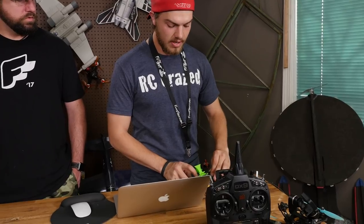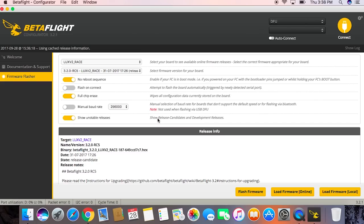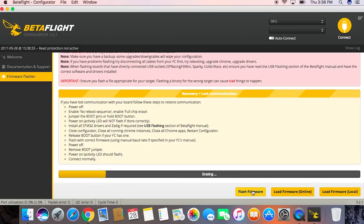In this case we have an easy button, so we'll press it while plugging in the USB simultaneously. That gets us into DFU mode, which we can see in the top corner. Then we'll flash our firmware — it's erasing previous data and will then flash and verify. One tip: I tend to leave it plugged into the flight controller, hold the button, and then plug it into the computer. Looks like we're successful.